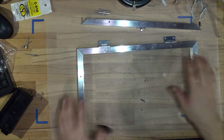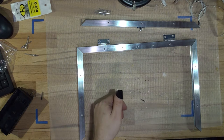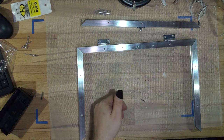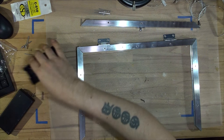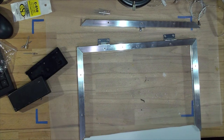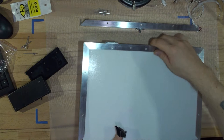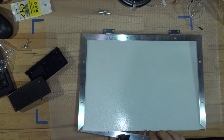Everything is ready. I'm attaching the hinges, lock, and corners. Those three holes on top are for holding the springs — front and back. The other holes will hold the plastic plate. Those two holes are for the project box that attaches here, with wires going through the middle hole. The next step is to slide the plate in — make sure you trim the corners because of the metal inside — then rivet the corners to the support and mark all the holes to drill in the plastic.